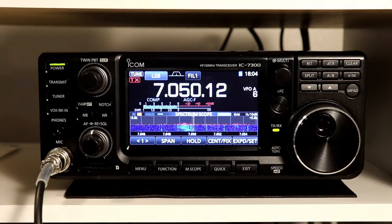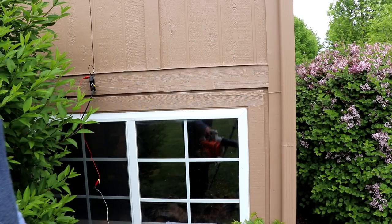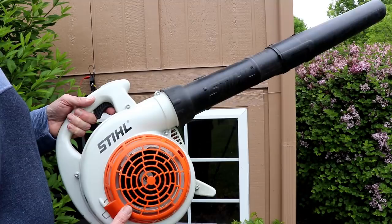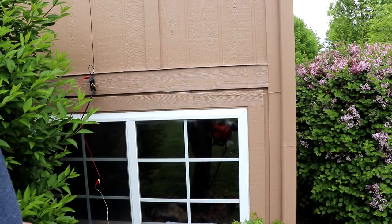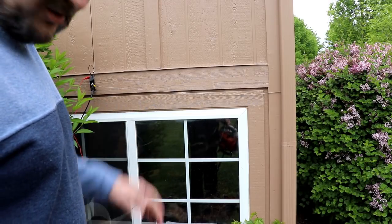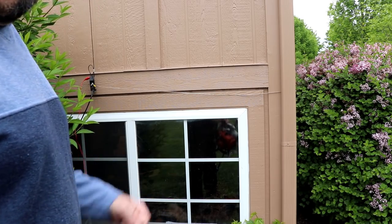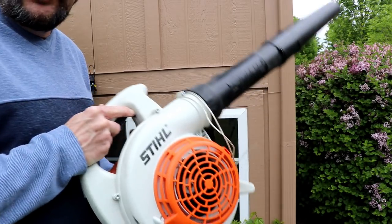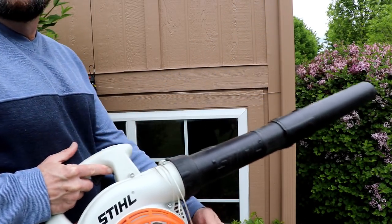Let's take a look at the noise blanker. The noise blanker is something that's primarily effective on ignition noise and pulse type noises. So if we're going to demonstrate that and play with the settings, we really need to have some pulse type or ignition type noises. In order to do some testing with it, we're going to use a source of ignition. I've got a little piece of wire here that I have clipped onto my antenna lead, and I'm going to take it and actually give it a wrap right around the ignition source. So we'll see how this works.